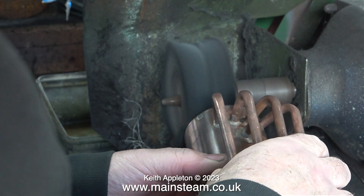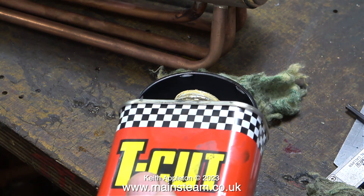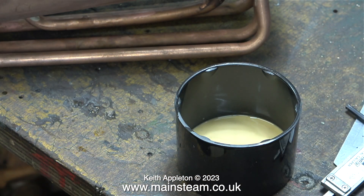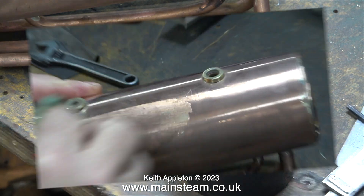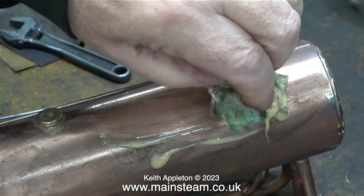This copper boiler took quite a long time to polish up. I'm going to use some T-cut to polish it further. I have to admit that the old Stuart 500 series copper boilers were not made of the best quality copper — some polish up okay, others don't. But I'm sure with a good application of T-cut, applying it with some Brasso wadding, I should eventually be able to get through the oxidisation and the boiler will start to shine.